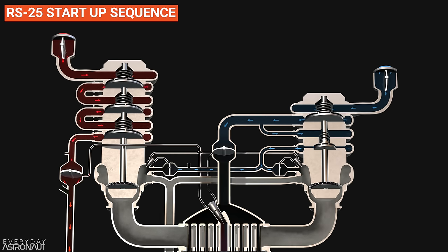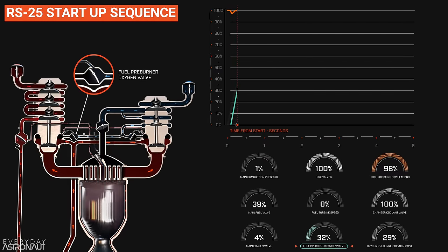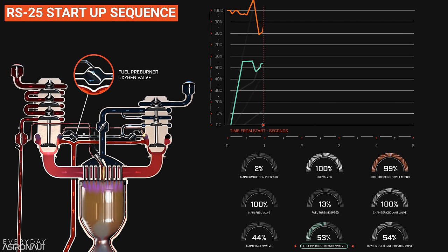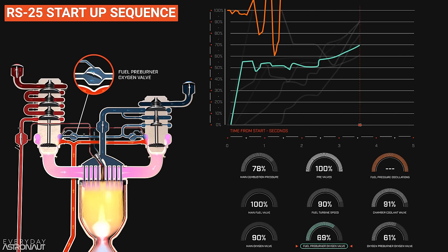As the propellant flash boils, it creates uncontrollable but predictable oscillations — one of the hardest things here, since everything has a little bit of a delayed reaction and you need to predict when the peaks and dips in pressure will occur. These oscillations will occur for about 1.5 seconds until the main combustion chamber reaches what's known as 'prime' — when the mass flow rate is stable on each side of the injector. So we've introduced fuel into the system, it's mostly flowing through the pumps and turbines, and beginning to get the engine spinning. Fuel is flowing through the three spark igniters and they have electrical power. Now we've got to start introducing oxygen.